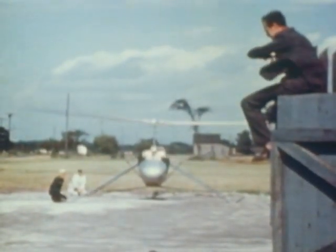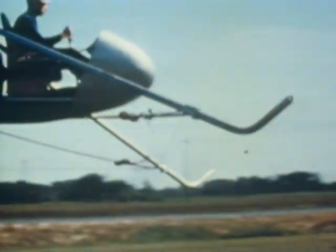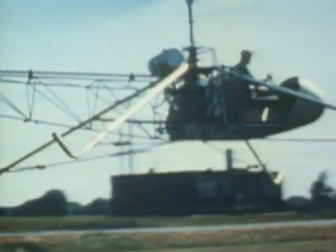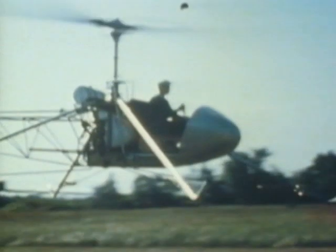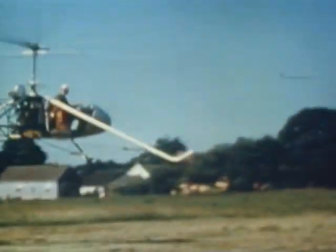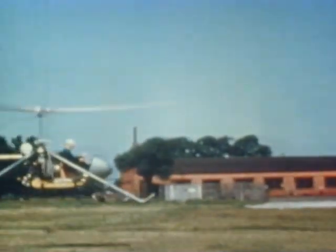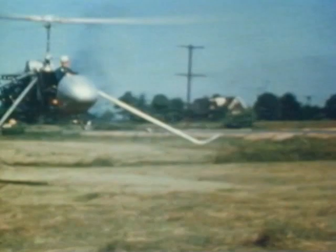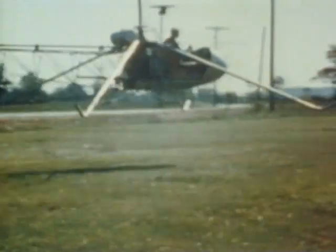This resulted in our putting dampers on the bar. They were automotive shock absorbers, which we'd found were also manufactured nearby in Buffalo. Floyd was then able to fly at reasonable speeds, but only up to about 20 miles an hour, when he encountered the same violent vibrations at twice per rotor revolution which Arthur had already uncovered during hovering with smoke blowing in the yard months earlier.